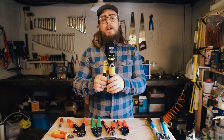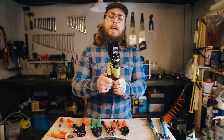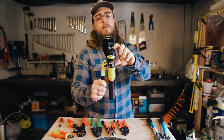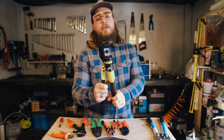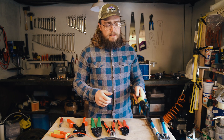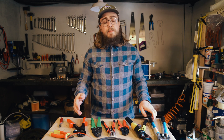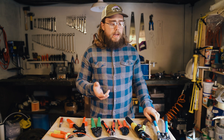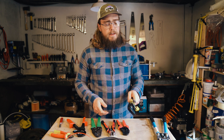The next option is one of these hand hydraulic crimping tools. In my opinion this gets a slightly better crimp than the first one because you're able to put more force on it. Again it works on the basis that once the dies close, that's a solid crimp. Provided you've sized your cabling and terminal correctly, that is a really solid choice. None of this stuff is super expensive either — this one is about 35 dollars or 28 pounds, and this one is slightly more at about 60 dollars or 50 pounds.